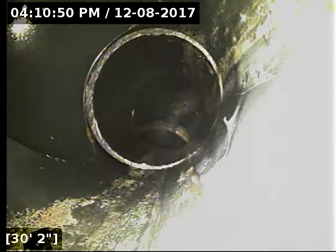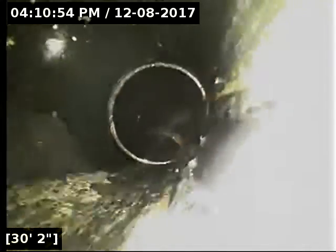I located the camera head at the external clean-out here. It was covered up by a bunch of grass and bulbs that had grown over it — it's going out the left side of the house and has been uncovered now. We're coming back through the crawlspace at this point. All the pipe leading up to the belly is in good shape and draining properly, and everything up to 62 feet is functioning properly.